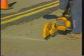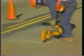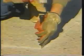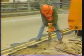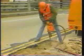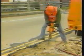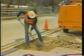Step three, prepare the hole. To start, cut along the marked edges. Use the concrete power saw to make vertical cuts about two centimeters deep. Do not cut the steel bars and do not saw beyond the corners, as this could cause spalling. If necessary, chip out the corners with a chisel and hammer. Next, break up and remove damaged portions of the concrete using a light jackhammer. Do not let the bit touch the reinforcing steel, since it will break the bond in the area where the concrete is still good. Remove the chipped loose material out of the way.